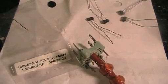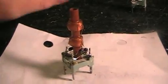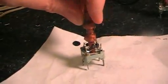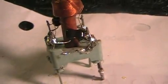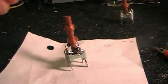Now it's time to change capacitors. I've got some 130 picofarads to put in there. Here you can see that I did put one capacitor across each winding and soldered it into place. The next thing I want to do is make sure I've got continuity, because anytime you get these lugs hot with that little tiny wire on there, you want to make sure that you didn't unsolder that wire. So I check each winding to make sure it's continuous. I also want to make sure that the lugs aren't bent out, because when I put the metal cover back over them, I don't want those lugs touching the metal cover — that will short them out as well.